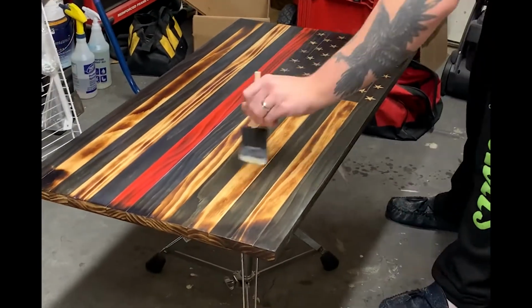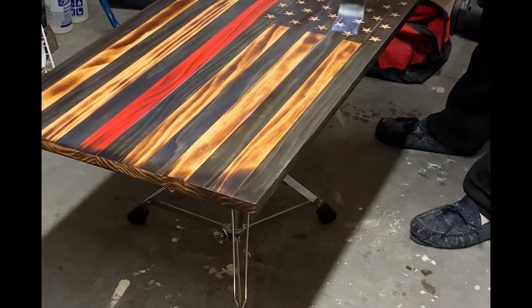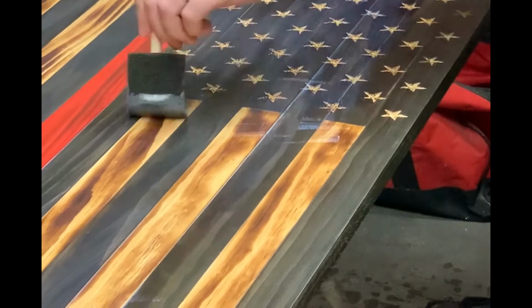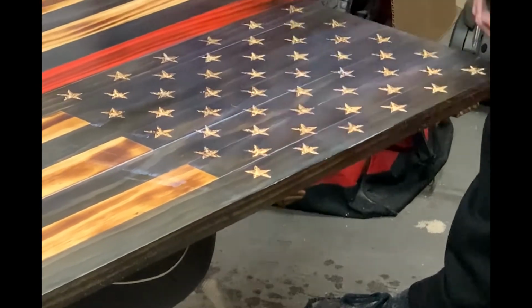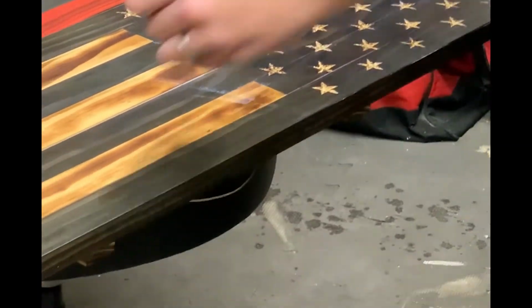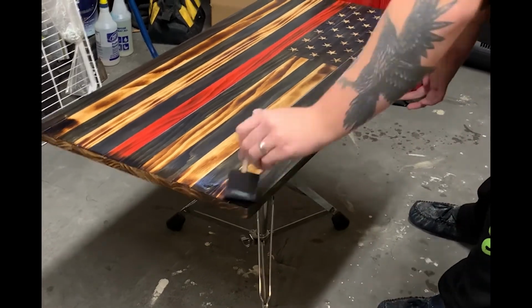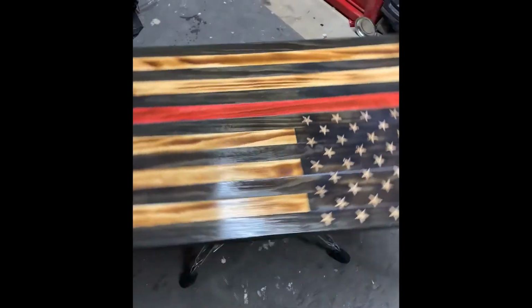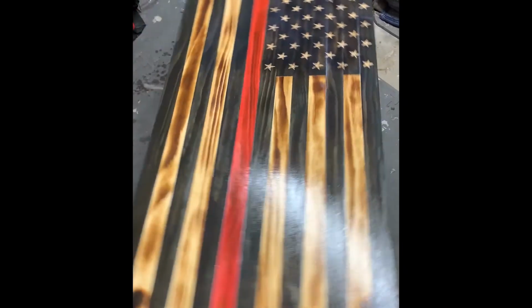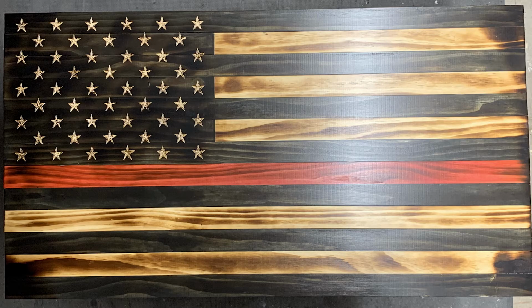Now I'm putting on a little bit heavier coat to absorb into the other. Polyurethane is a self-absorbing bond, so when you start applying the second coat, they kind of melt into each other, so everything will auto-correct if there are little imperfections here and there. So evenly, I'm just spreading everything on, getting a nice even coverage, and then again, we are just gonna let it roll out and wait for the second coat to dry and see how we make out. It's nice, you could see the sheen is way heavier here, and then after some dry time, that looks way nicer.